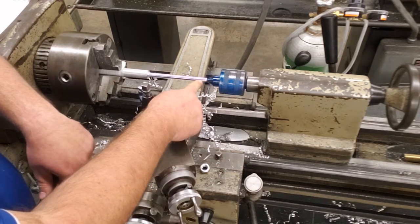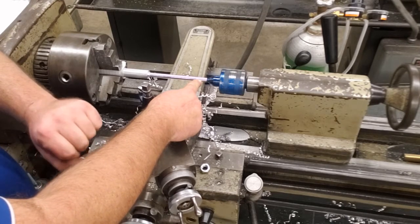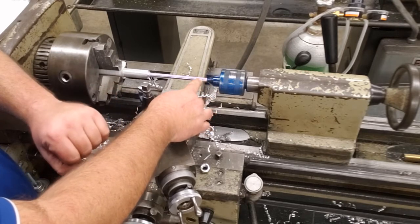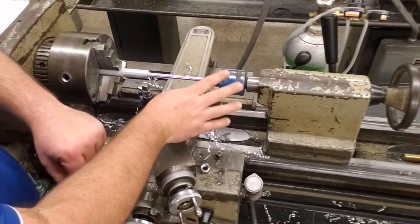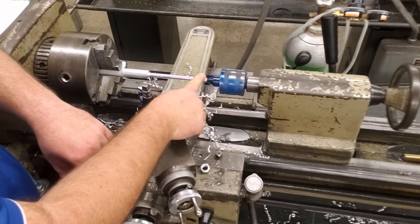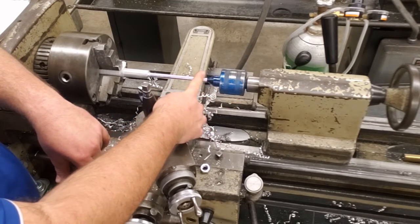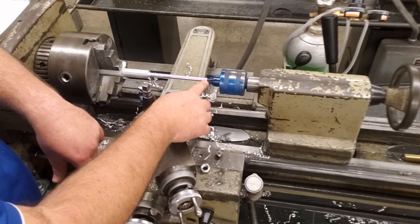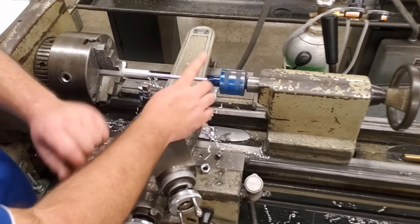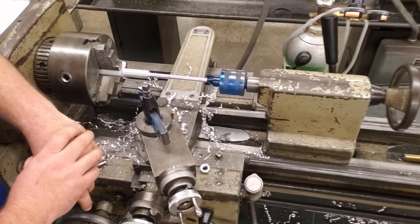We also have to cut a little bit of material off the end of this. Commonly, I've done it on the lathe before we finish up on the lathe and we call it done and we cut it off there. But just in case we have an issue when we make the hammerhead, we don't want to sell ourselves short and cut that off. Otherwise, we may have to potentially re-drill it if we have to do any more turning work on this. So we're going to leave this center drilled on the end. Later down the road, we're going to cut this off of here and put a chamfer on this end. We'll show you folks how to do that. Okay, that is the machine work for the hammer handle.